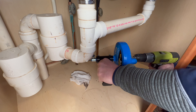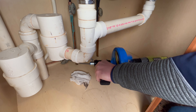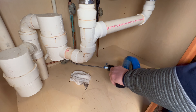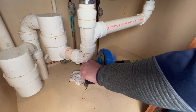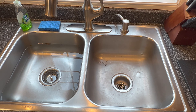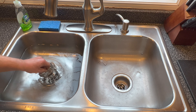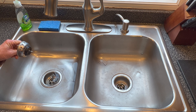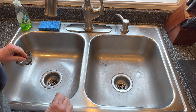Make sure the thumb screw is tight — going on slow speed. So I spent about 30 minutes snaking out the drain. I went through 3 90s and 1 45, all the way to the four-inch main. I think I have it cleaned out. I've got everything put back together now and I have one sink filled up — let's see how this works. Look at that — drained right down nicely. Nothing came up on the other side at all.